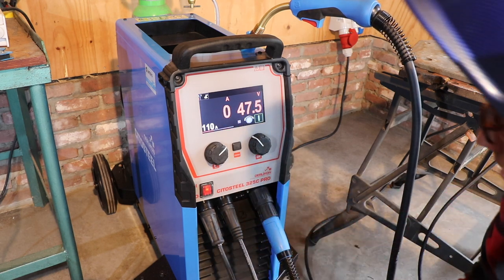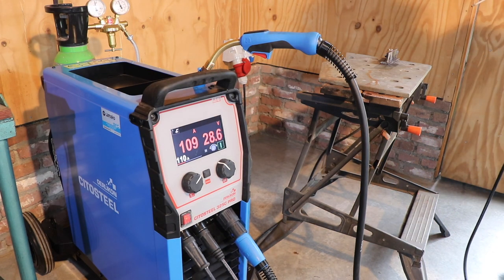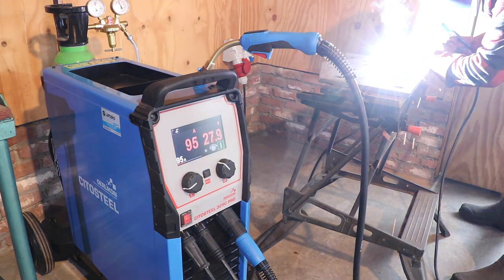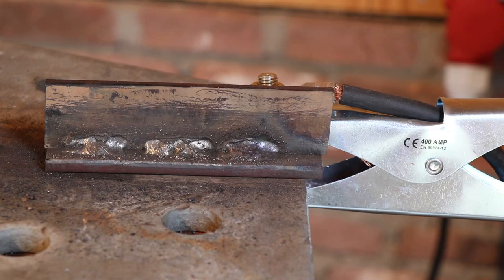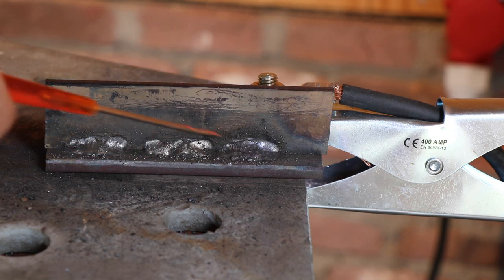It's cutting quite deep, so I'll try some different amps. Here you see the results: 110 amps, 95 amps, and 125 amps. So 95 was already quite low, and 125 is a little bit higher. Looking at the weld I think a little bit less amperage is better. It's the first time I'm welding with MMA on such a strong system, and I really need to see what welds best - really get to know the hang of this system.